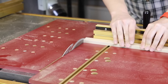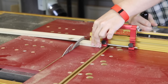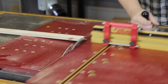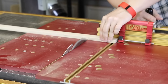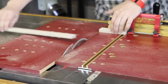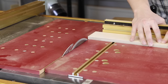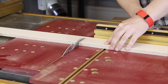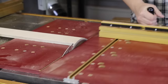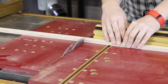Then at the crosscut sled, the first thing I did was I squared up one end of my inch and a quarter wide strip, and then I cut a piece three inches tall off — that would be the spacer for the mortise. I then cut two more pieces that were four and a half inches long. Then with my three inch wide strip, I cut two pieces to twelve inches long. And with the one inch strip, I cut two pieces to twelve inches long. And that brings you to now.